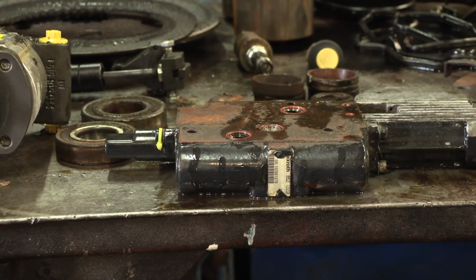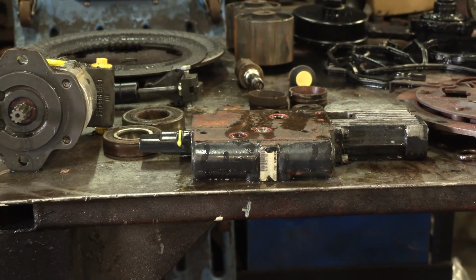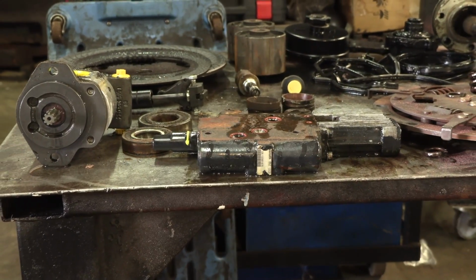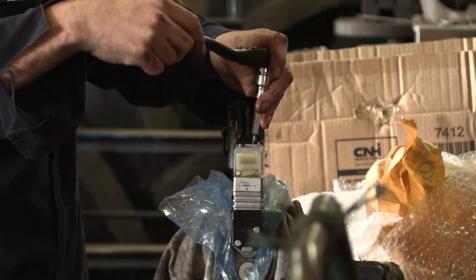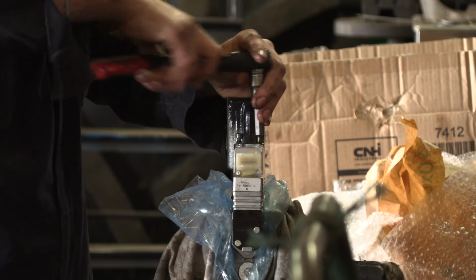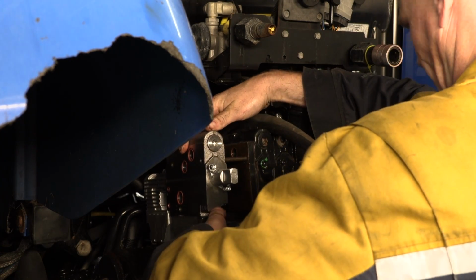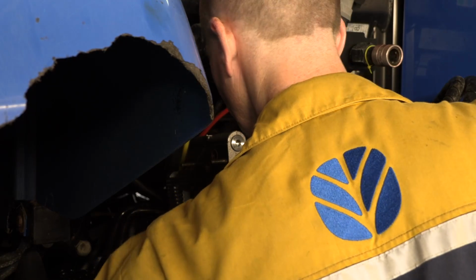It doesn't have its own lever, it's just on a switch. Because I was going to say there are only 4 levers up there. That's on a wee rocker switch, so you just have power both ways, no float, but it wasn't working. So after looking at it for a while, we had to change the slice, put a new slice on it. So that's replaced, and all 5 spools are working now.